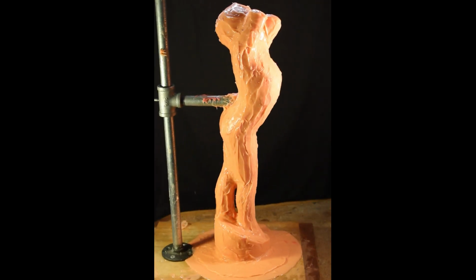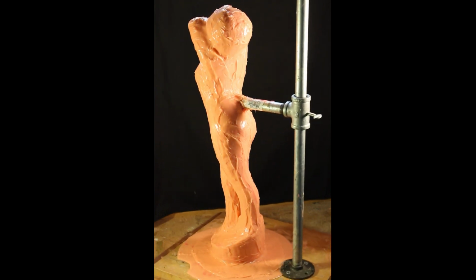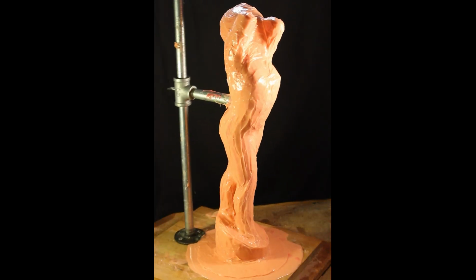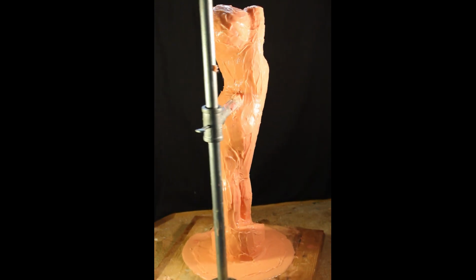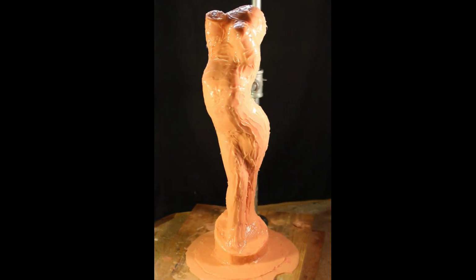So stick around for those other videos that show how to make the mother mold, how to get the pipe out of the back, and how to cut a mold open to do a slice mold. So that does it here. Those are all the layers that I'm going to do. It should give me an overall thickness of about 3/8 of an inch. There might be 3/16 of an inch up to, I don't know, about half an inch maybe in some places. This is where we're at.